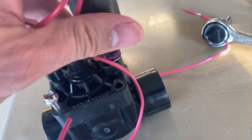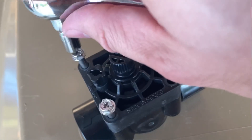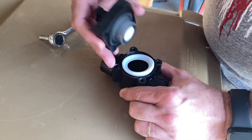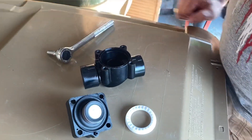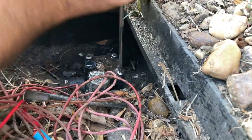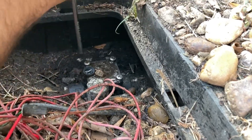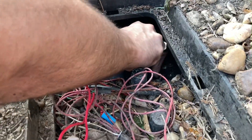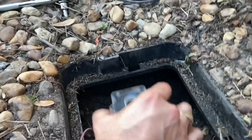By replacing the bonnet of the valve, that should replace all of the components and get it working. The first thing I'm going to do is remove the bonnet from the new valve. I just took the solenoid off and now I'm removing the top. There is a white ring on the inside that you want to make sure you grab. Next I'm removing the old bonnet. The old bonnet is in pretty bad shape — you can see it just fell right apart.